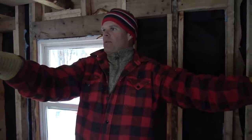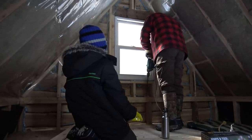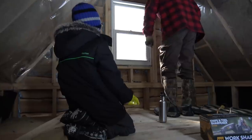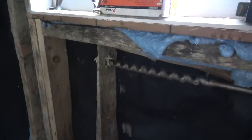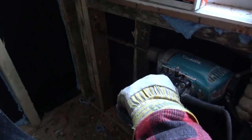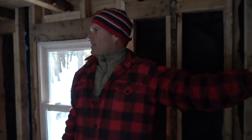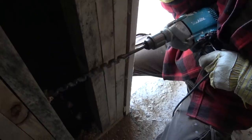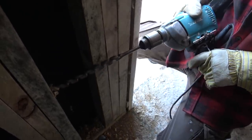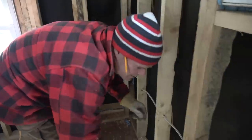He wants to put two switches at the door. One is going to run an outdoor light. One is going to run the pot lights for the upstairs. And then he wants another switch on the other wall. They're going to run the sconce lighting, one on each wall. So I just have to figure out the best way to get across to the light switch and then back using the least amount of wire. Simple and fun.